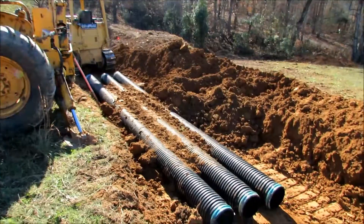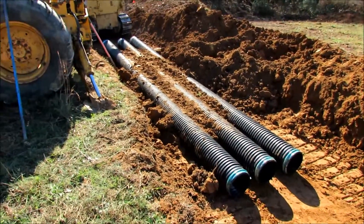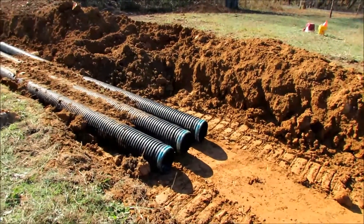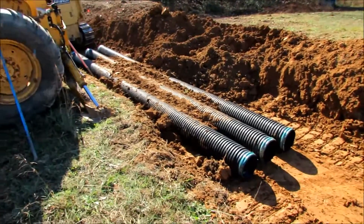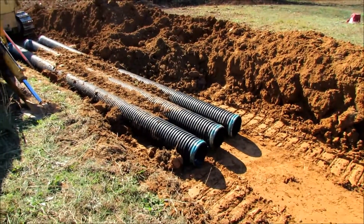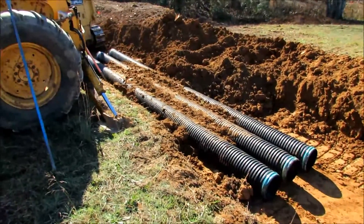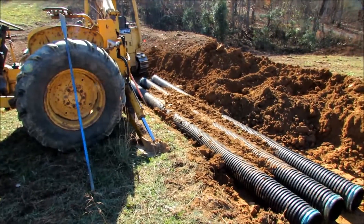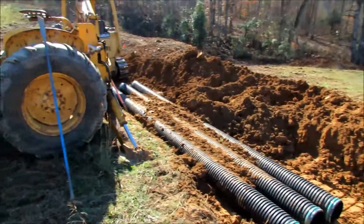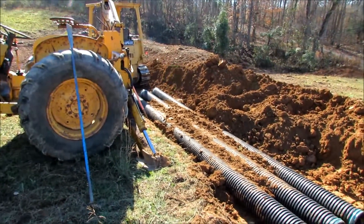And that's how that's going to work. They should be able to handle the flow here — this is just rainwater runoff. I've seen my lower swales handle a lot more water than's going to fall on here, and I only have two culverts there. But of course they're not attached to a dam, so I'm erring on the side of caution here just to make sure the dam stays safe. So I'm going to push this dirt over the culverts and start to roll it in and make the roadbed.